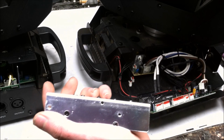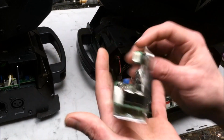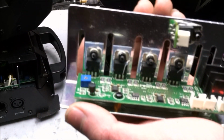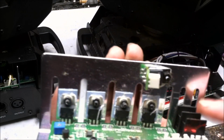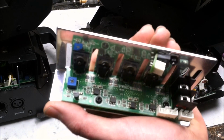Of course, on the other side is where the power supply was, and he drilled into the photocoupler feedback circuit. Very simple board to look at, not much going on here. Let's look at it and diagnose it and see if there's anything that could be wrong. He said that the lights came on for a couple of seconds and then went off. So this board that actually controls whether the LEDs are on or off is probably operational. Looks like a very simple board here.